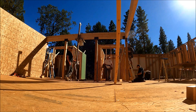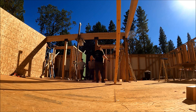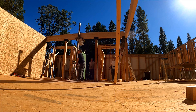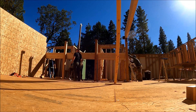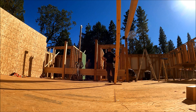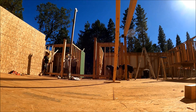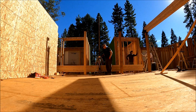After we put it up in the air, we realized where the two glulams come together in the corner, there was a big gap between the two glulams because the bracket is about a quarter inch or more thick. So we had to bring that one back down and Mark notched out the bottom of that glulam for us. Then we were able to send it back up and it fit nicely.